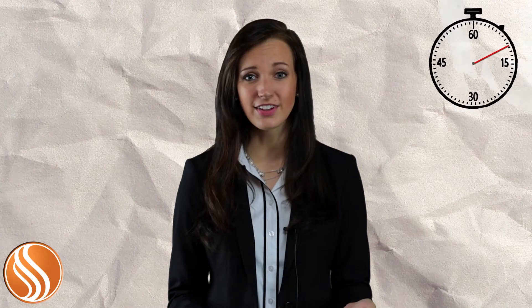While it may look like the bricklayer missed filling these with mortar, they're actually created there intentionally, and they serve a very important purpose. Weep holes both allow water to escape from behind the brick and allow air to enter the cavity between the brick and the sheathing, also called wallboard.